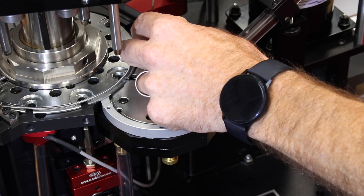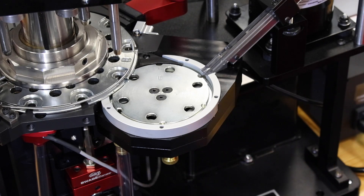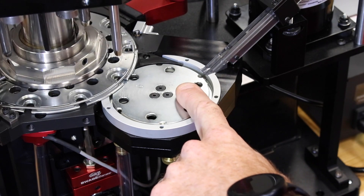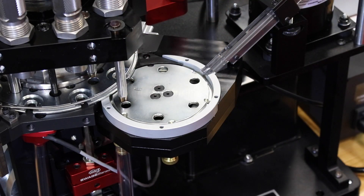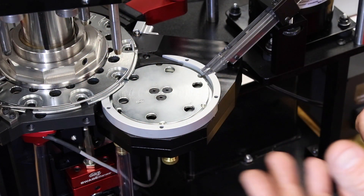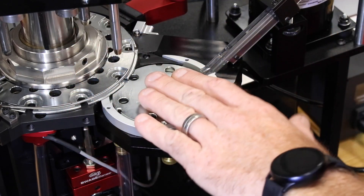The disc is a safety feature — it's spring loaded. With the press running, if I create drag or resistance on it, the press stops and I get a digital clutch error, requiring me to jog up to get off of it. We did this on purpose to prevent a detonation if possible from the priming system.